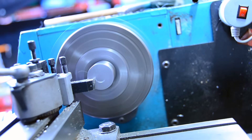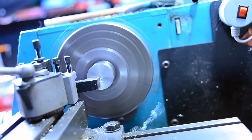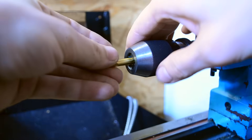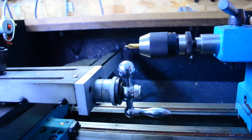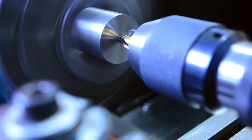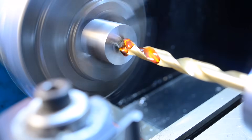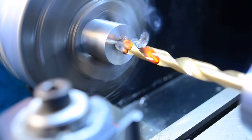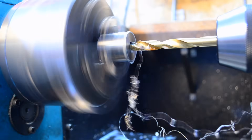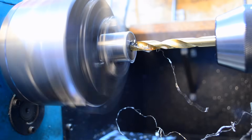I'm going to face the part off first. Machining titanium is a little bit like attempting a burn-up-your-drill-bit any percent speed run. Ideally I would use solid carbide drills, but just buying the material for this build has depleted my budget for the video, so high speed steel it is.